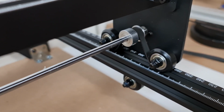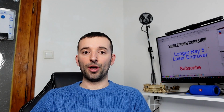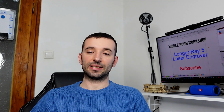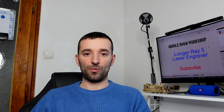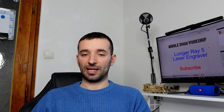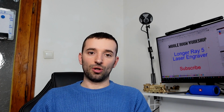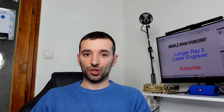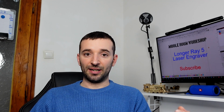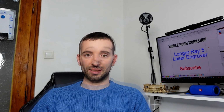So, in my opinion, they could have simply put the extra screw on the opposite side, and it would have made things way simpler. You could have squared it right away without having to test and trial a couple of times. And then the third thing is that the machine has no home, or in other words, it doesn't have limiting micro switches which define the physical origin position 0,0 of the axis.